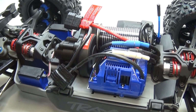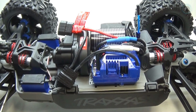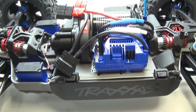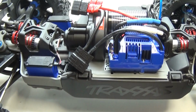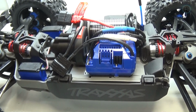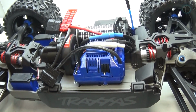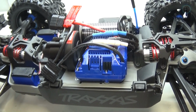But yes, another thing that I should mention with the LiPo batteries is all their features also have to be aligned with each other. They have to have the same C and the same cell strength. You want 2 3S's with 30C and highly preferable the same milliamp as well. You want these batteries both fully charged and equal. That way the system can really utilize its full potential. Otherwise, if anything's off, it could cause some electrical things down the road.